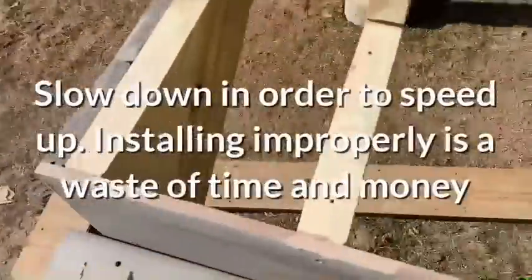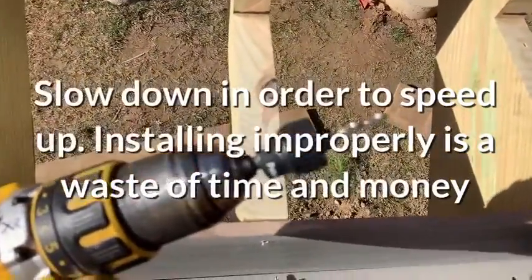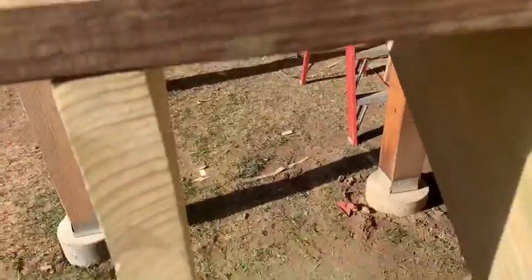This bit right here is metered. It's a set depth. In other words, when you go down with it, that's the hole that it makes. And then whichever screw you decide to put in, whether it's a trim screw for a vertical or a deck screw, it's supposed to crush the material inside, compress the material inside that hole, and countersink appropriately.